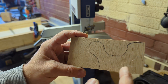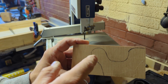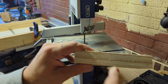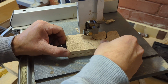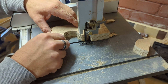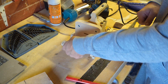I've made a couple of changes to the design. I want a handle on the front of my fence so I've got another place to support it. So instead of just having a right angle as a bracket for the fence, I've created this shape — there'll be two of these, one on either side, and I'll put a handle like a bar through the ends. To ensure I get exactly the same shape twice, I just hot-glued a couple of bits of ply together, cut them out on the bandsaw, then separated them again. So essentially the fence will go like that, with a handle running across the top.